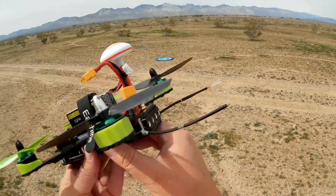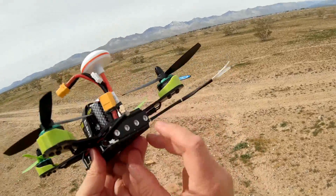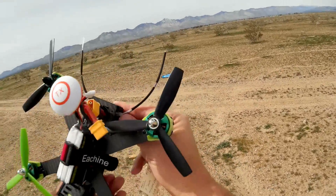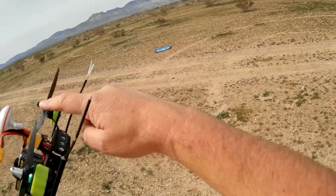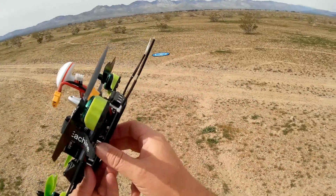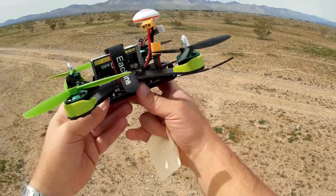And finally, the video transmitter receiver antennas were just flopping around. What you'll need to do is use zip ties or anything to stiffen them up and keep them out of the plane of the propeller. I use zip ties from the dollar store along with some shrink tubing to hold them and stiffen them up, and hopefully that'll keep them out of the plane of the propeller.